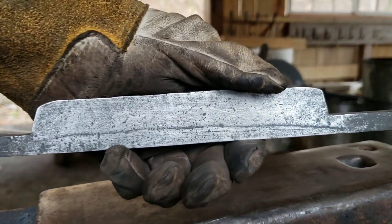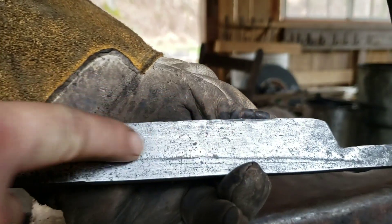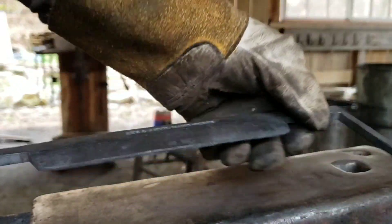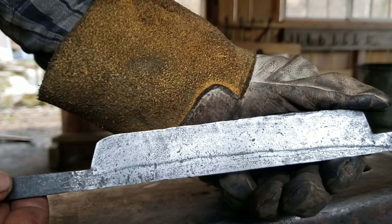I've polished the back of the laminated blade. There's a layer of high carbon steel back here, but the body of the draw knife is wrought iron. It's wrought iron on this side as well, so you can clearly see the steel laid on the back there.